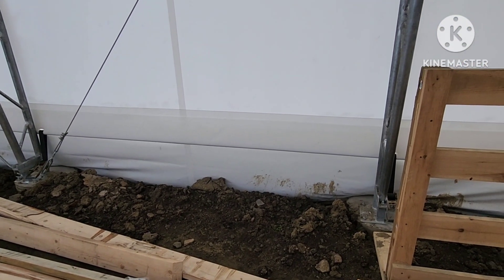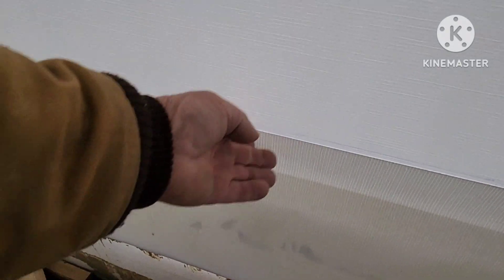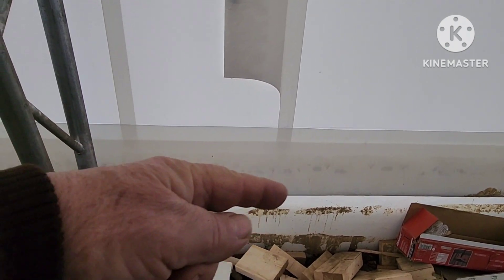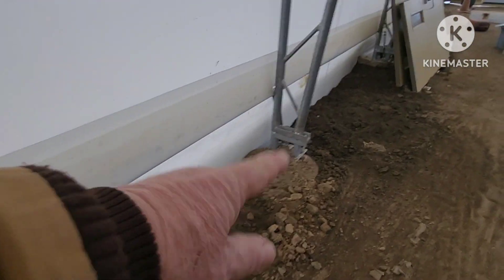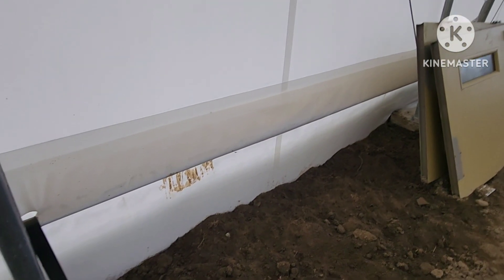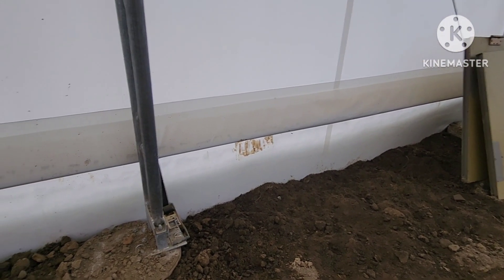Along the walls, the building fabric comes down. When they make it, they melt these together — there are videos online on how they make them. It's an Amish-run company in Missouri that makes this fabric top, with imported materials. That's what holds it down, but I took the skirting and buried it on the outside in stone. I made a trench — I filled it in already — and on top of the skirting I put pipe, making a trench that drops about an inch every ten feet, or a little less, to carry the water away. That skirting is buried in stone.